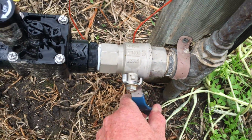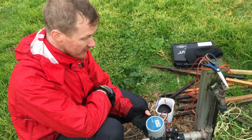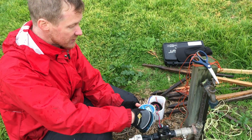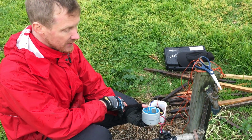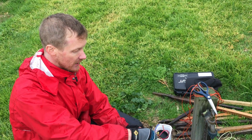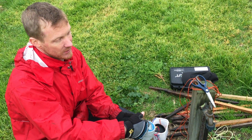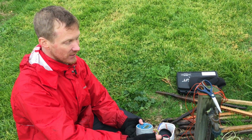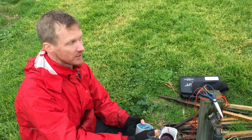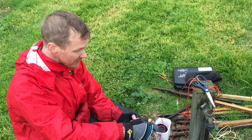That's right. This little remote node is pretty flexible, and it will allow you to have different irrigation programs, up to 3 in the case of this device. You can set the irrigation to come on once through multiple times, 3 to 4 times per day for different lengths of time. You can also alter the time or days during the week you would like this to happen. I think when we first set this up, we wanted it to run with an interval of 3 or 4 days in between cycles. Then you can just watch it and come and change it as you like, or you can run it manually. Sure. And that's really it.